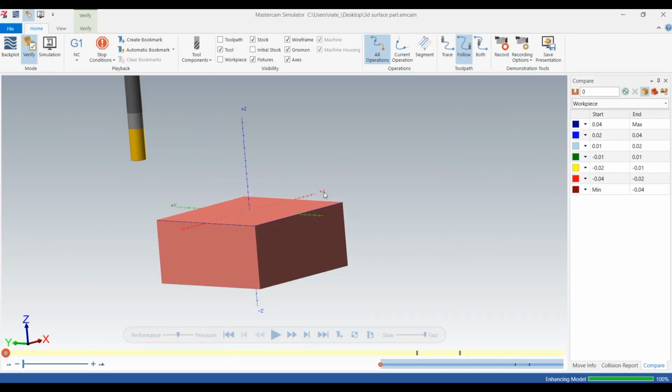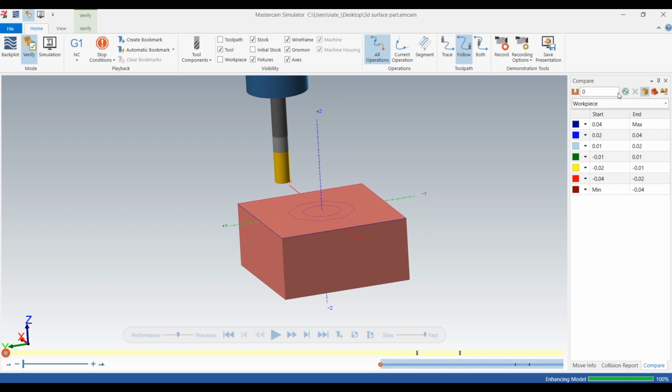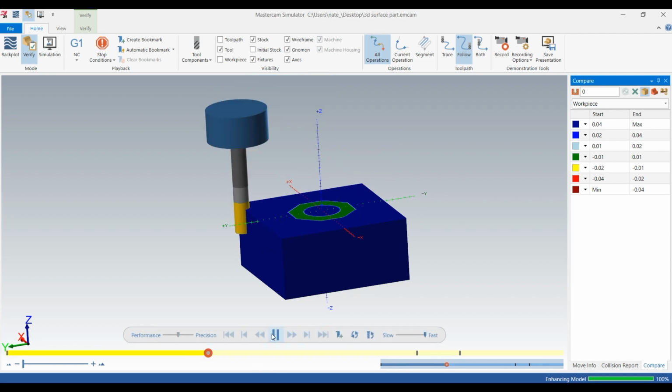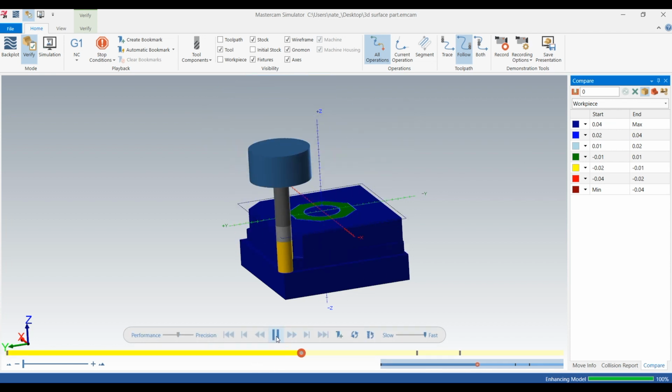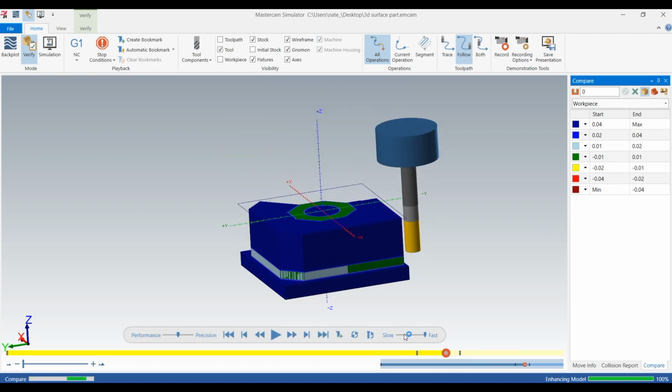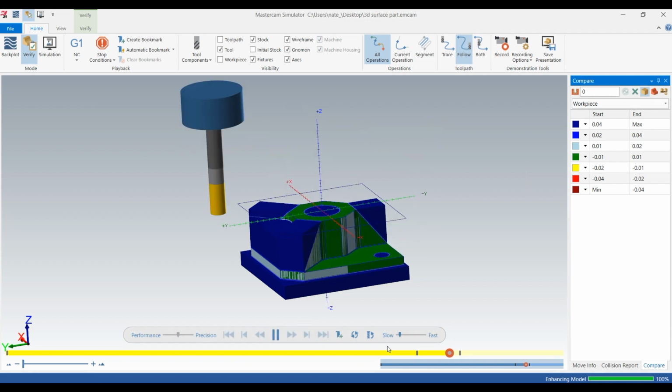I like to use this on really steep angles that are deep, because say the angle is 1.5 inches deep and your end mill only has 1 inch of flute length. When you do a flow line, it will engage on the shank and you'll break your tool. So this is a great toolpath for those really long deep angles.